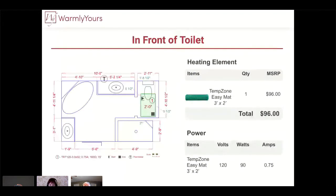Heating in front of the toilet — when it comes to heating around toilets, you don't want to get under the flange bolts, because if you drill a hole through your floor to put the flange bolts in, you have a chance of hitting the wire. Also, you want to make sure that the heating wire is not going to melt your wax ring. We always suggest that you keep the heat at least four inches from the wax ring — four inches is plenty enough room to stay away from it.